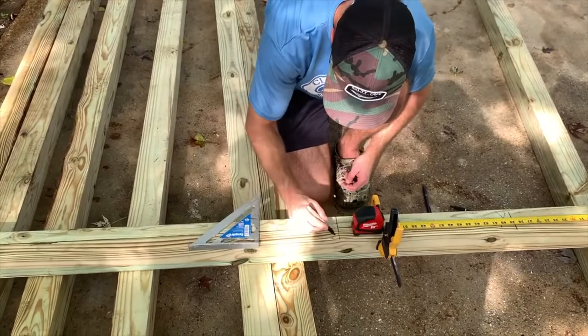Once you've cut all of the jack studs, cripple studs, etc. to length, we can go ahead and assemble it in place on the wall. At this stage, take all of your window components and start placing them within your side wall. So here I am taking the 4-foot cripple studs at the bottom, positioning them adjacent to the full studs, and then I'm taking my sill plate right there, dry fitting to make sure that I'm content with how everything looks.